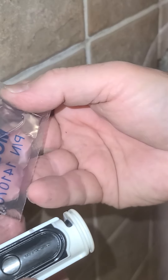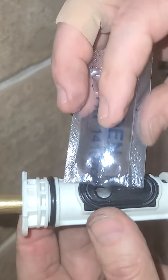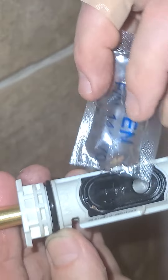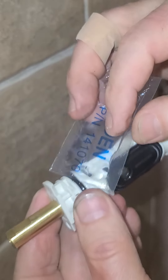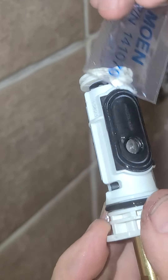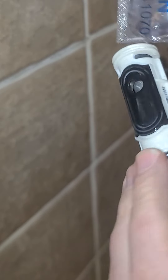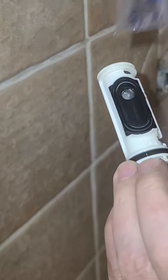This kit comes with Moen part number 141070 rubber lube. We're going to put this lube all over all of the rubber components. That's going to protect them as we slide them in, even on the O-rings here — we're going to slather that on there too so those O-rings don't have any issue. It's kind of odd that there's not an O-ring down here, but I guess it doesn't really need to be — where's it going to leak, right? We're just going to drip this thing and get it nice and gooey. Make sure that none of the rubber is dry.